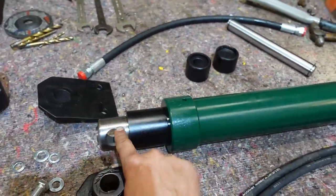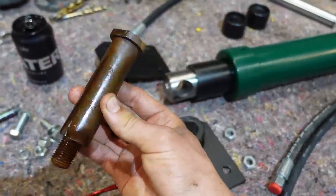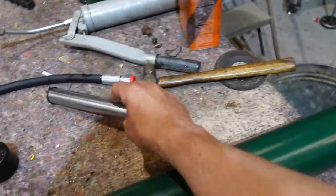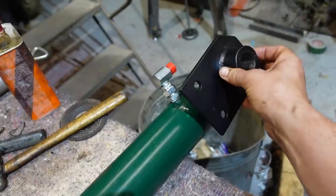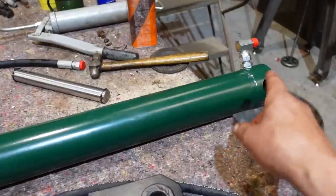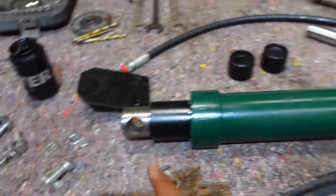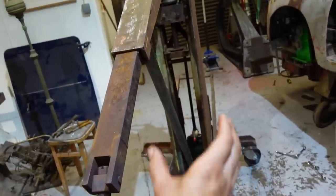So we've got the main ram - this is the top and it has a pin that runs through, which is this. Glen has made this brand new. The plan is to assemble all of this on the bench, hang the piston from there onto the actual arm through there, jack the end of this up until it matches, swing it in, and put the bolts in. Whether it goes as straightforward as that, who knows - I doubt it - but that's my plan and I'm sticking to it.